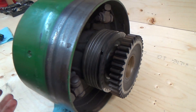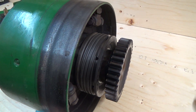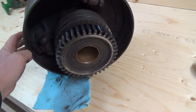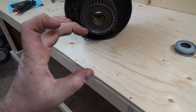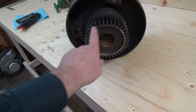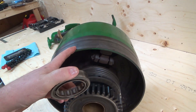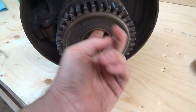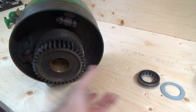This thing, when it spins - normally the engine's here and there's a great big shaft from the crankshaft that goes through. The two big cylinders are up here, banging away. Well, this thing is constantly spinning in here. So this bearing - when you don't have it engaged and this is stopped, that big crankshaft is spinning in this bearing, and in this big bronze bushing in here too. So you really got to make sure you get some lube in there. Now there will be lube in there because this is like right in the big gear, and the oil and stuff will get splashed in there, but you don't want to put it in dry because that shaft is pretty long - it's probably almost a foot long.